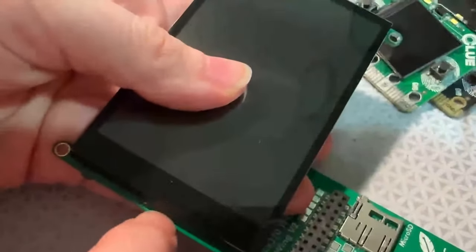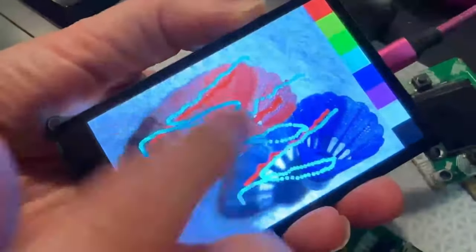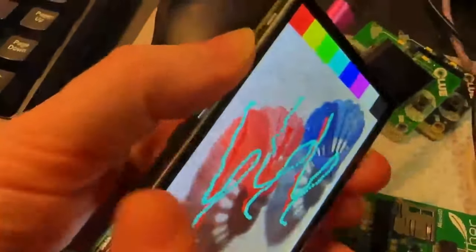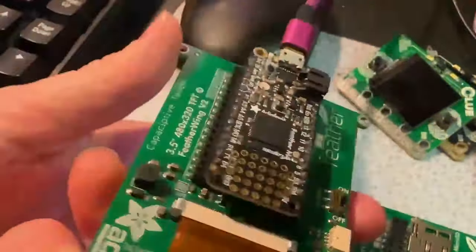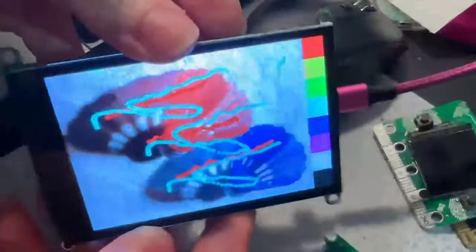This moved down basically about a tenth of an inch, but now it's good to go. I wrote the final test for this which reads from the SD card, and you can do a touch check — it's multi-touch, so you can have up to five fingers at the same time. I'm going to book this board, and then you can plug in any Feather and get a really beautiful capacitive touch display.